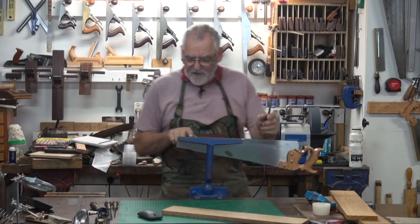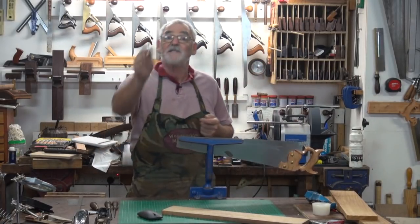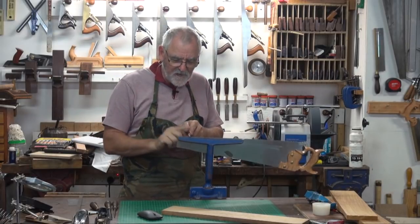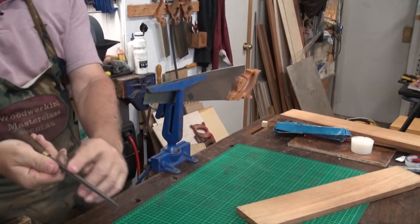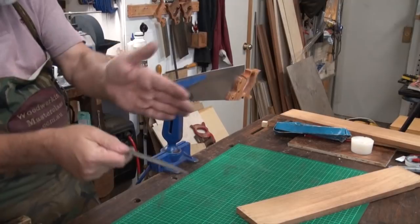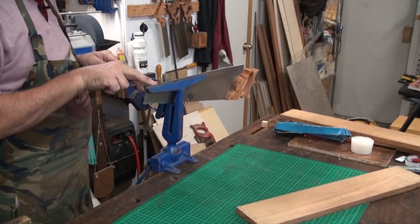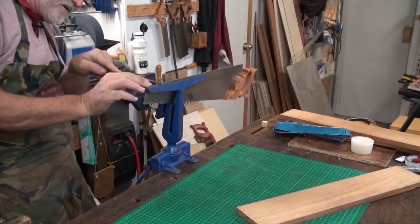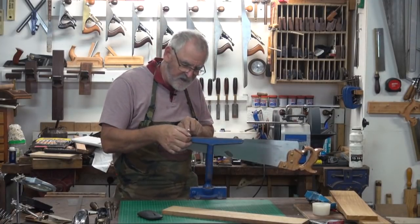Okay, now let's give me a progressional cut on the first 2 inches. And that's courtesy of Mr. Sellers. Now we bring it around. You don't worry about what the top's doing now, but you look at this edge here that you're going to be filing, and that has to be straight up and down, perpendicular. You can see where you filed because you've got nice shiny spots at the bottom of the gullets. And now you hold that at 90 degrees and just give it 2 or 3. So here we go.